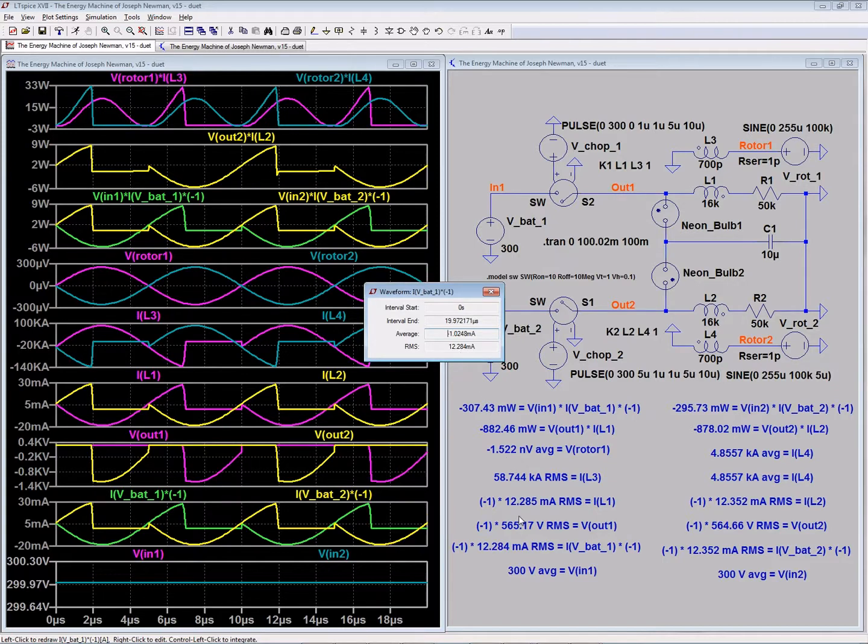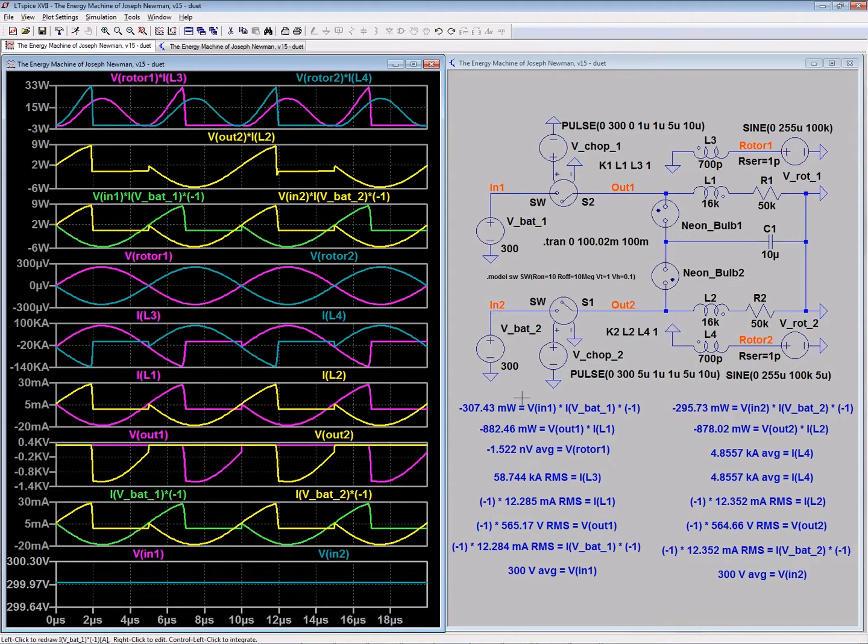So I'm using the 12, but I'm taking the sign from the average and adding it back in to make it obvious here, because you're never going to have it when you take an RMS. RMS involves squares and square roots, and the root means square. So when you square something, you lose the negative value, if there was one. And I have to put it back in. So I use the average to tell me whether or not it was originally negative.